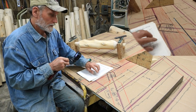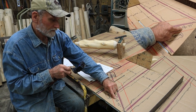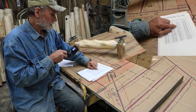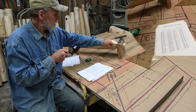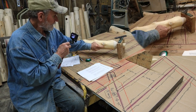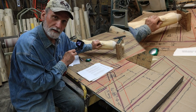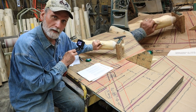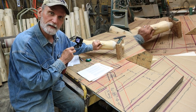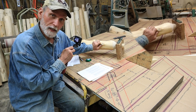So we have the number that started off at 50 3/4 minus something, somewhere between 5 and 6. We come up with an easy number, which is 45. So when we go to the drill press, we go from the center of the first spindle, which is really in the post. We come over to the center right here, because we're going to be dealing with the exact center of the workpiece at the drill press, which we have a video out there on how to make a tilting column drill press from a conventional drill press. You want something that's got 1.5 horsepower and a 4 3/4 spindle travel, if at all possible.